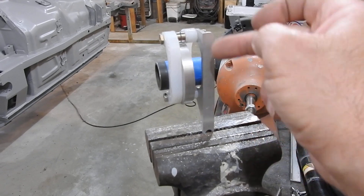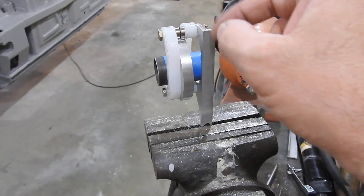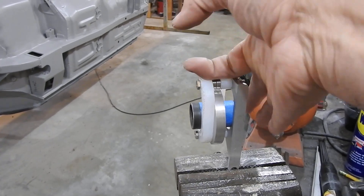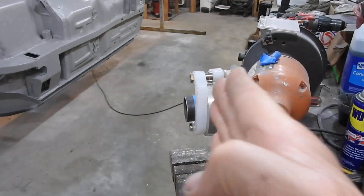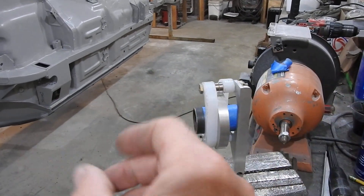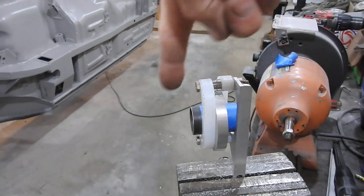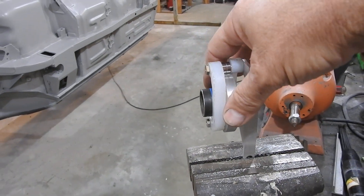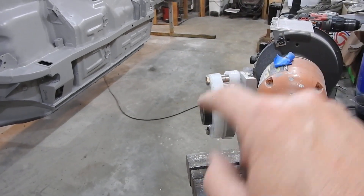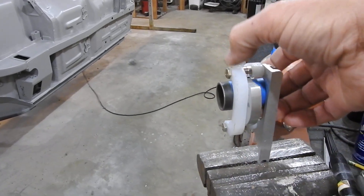So what I'm going to need to do is — this piece is just a test piece. I may go to a quarter-inch thick material. The other problem I have is the gear, when it comes up, the physical landing gear comes real close to this and it may end up hitting it if I keep it right centered. So I can move it off to the right or left. There's a pocketed area in the gear torque tube because there are two tubes that come out straight from here — one here and one here. So it fits perfect in the middle, but I think the landing gear strut itself is going to touch this because that thing comes down and comes closer than a half inch.